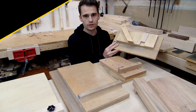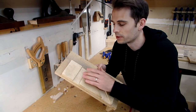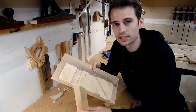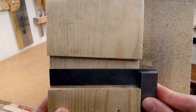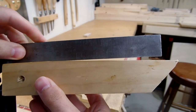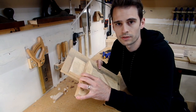We'll begin with Paul Sellers' version. Paul's version features a single narrow board with a 90 and a 45 degree recess cut into it, in which you can take a fence and slide it into place. Each recess is cut at an angle on the back that corresponds to an angle cut on the fence, so that when you slide it in, it creates a wedging motion that locks everything into place.